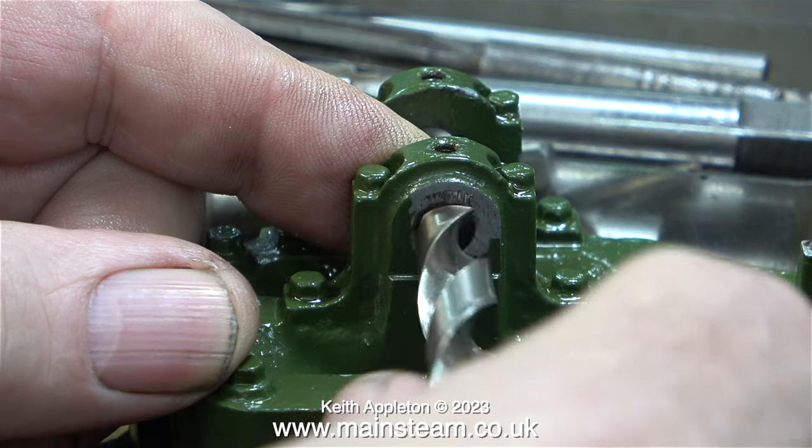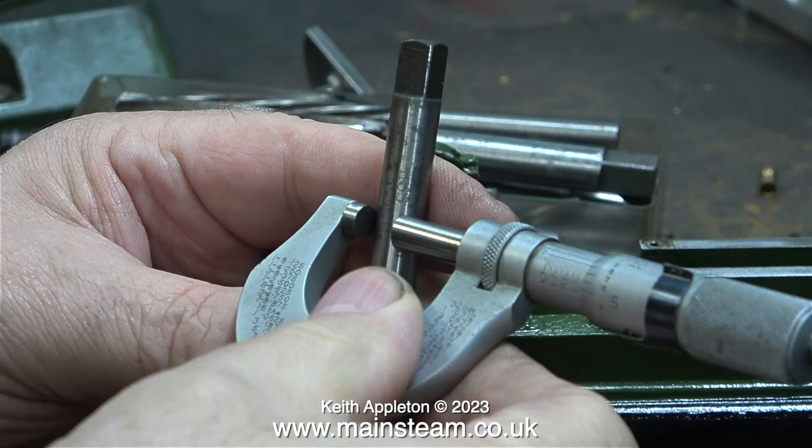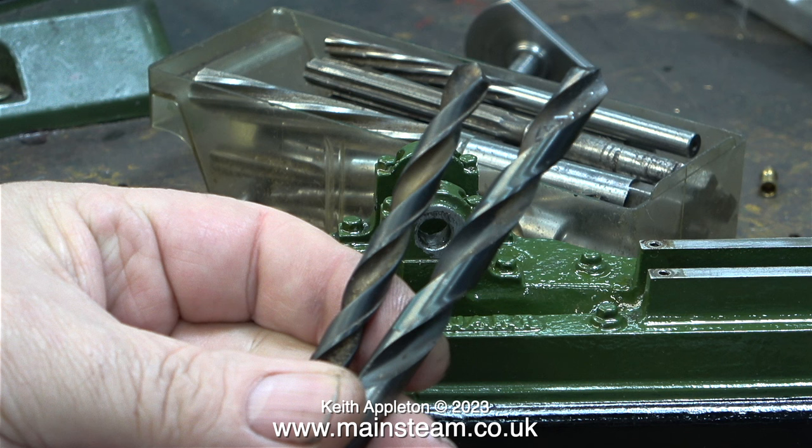I'm a bit concerned that the existing holes in this part of the casting are not in the centre — it's not a massive issue, but it's not going to look too good when the hole is enlarged. I'm checking the size of the reamer; this one is 3/8ths of an inch. When reaming I would normally use one imperial drill size less than 3/8ths, but for this job I'm going to use two smaller twist drill bits because I have a feeling they're not going to line up properly and I may need to file them. Drilling with the smaller one first gives me an escape route — if they don't line up I can adjust with a file, then re-drill with the larger size.